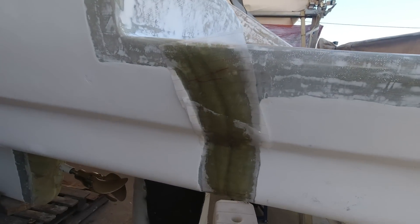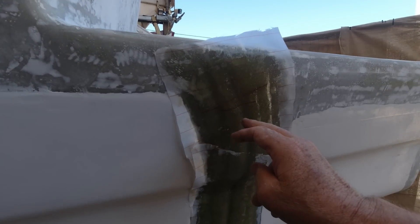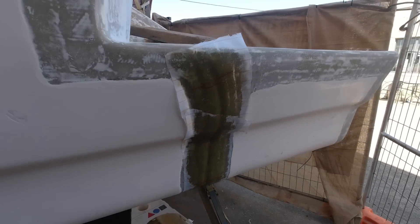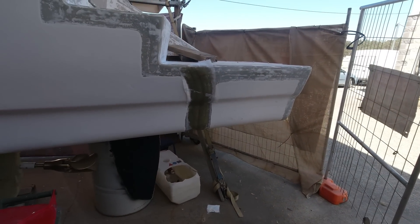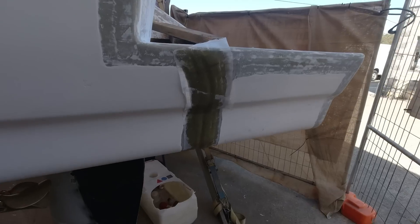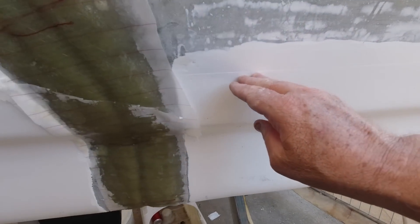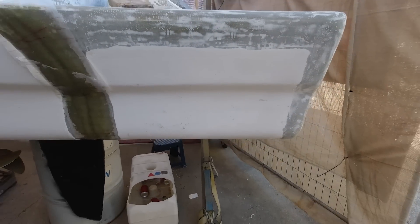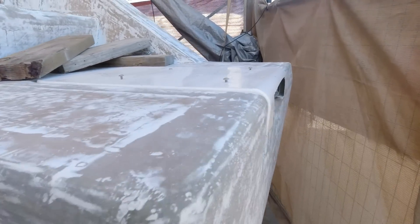Right, that's the last bit. This is going to take a bit of fairing to get right, but what I've been able to do is get rid of the dent there — that should fair down to pretty flat. Then it's just going to be basically a really light scrim over the top fairing. I can basically get that done, and most of that's below the waterline. In fact, here is the anti-foul line off the mould — the mould was taken off the last boat they made, it was an extension they did, so I was lucky enough to have those moulds to do these extensions.